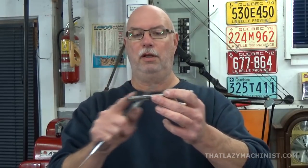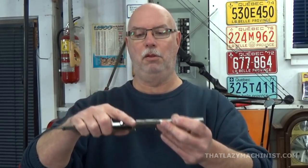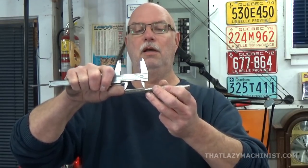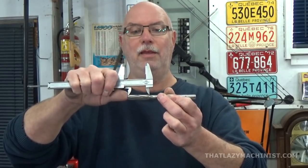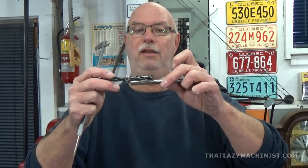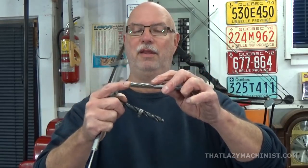And once that is done, I'm going to be using a reamer, and I want to make sure that I can ream without any problem. I can see here that the length of the cutting teeth on my reamer is about the same as the finished length of the part, what I'm going to have before surfacing the second end. And if I check here, I can see that because I've planned it that way, the hole that I'm going to produce is going to end up being even a little deeper than that.